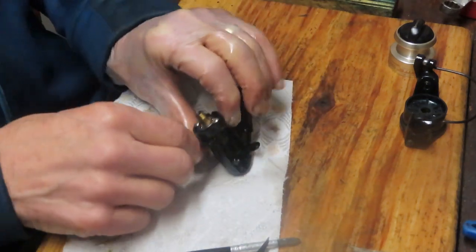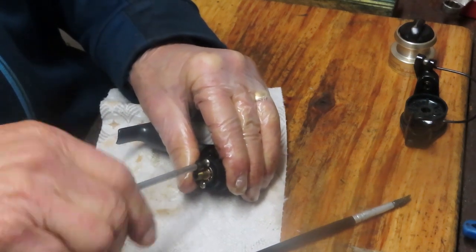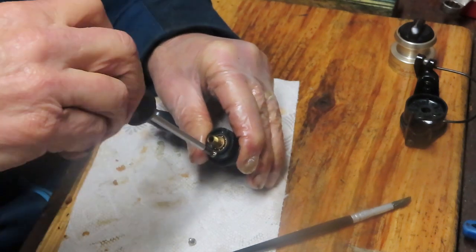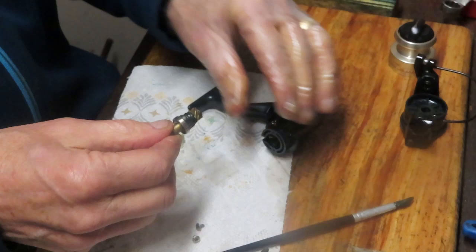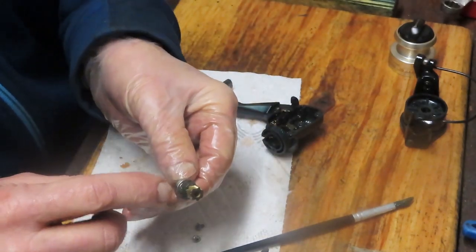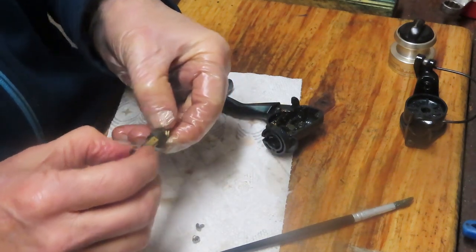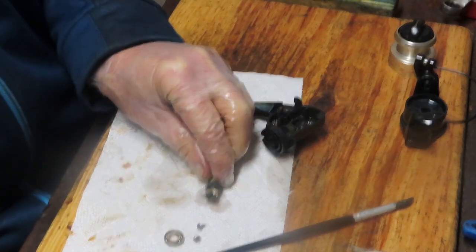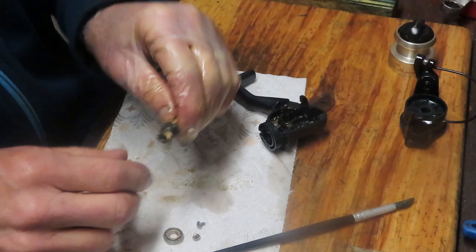Last part up is to remove the bearing and the pinion gear shaft. This is held on by two screws that act as a collar — there is no tie-down collar on this one. The components seem to be very good. Am I looking at pot metal for the gears? I am. But it's a lower-sized reel where catching a four-pound fish is probably out of the ordinary. Here you can see the anti-reverse click ratchet, and we've got some grease underneath. I'm going to pull that bearing. That plastic piece — I imagine it's a collar you could remove, but it seems a little brittle after 20 years.